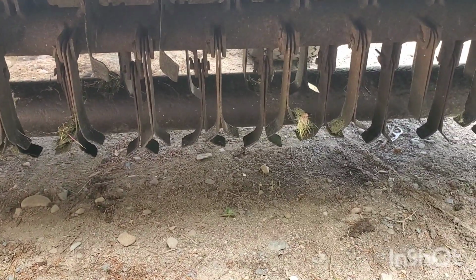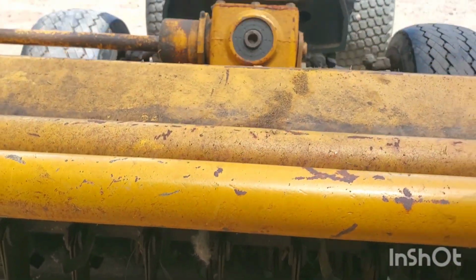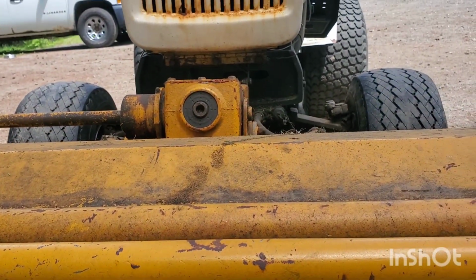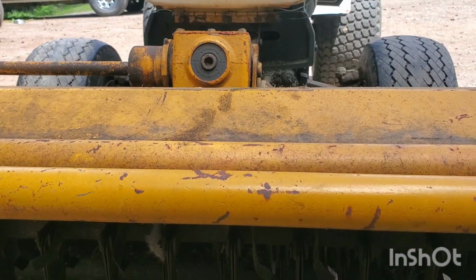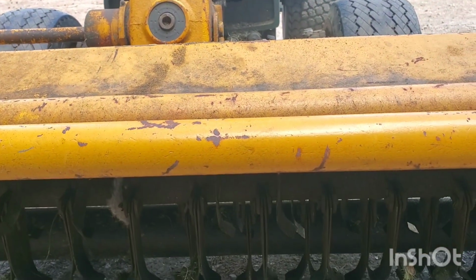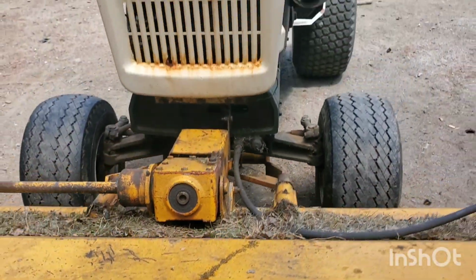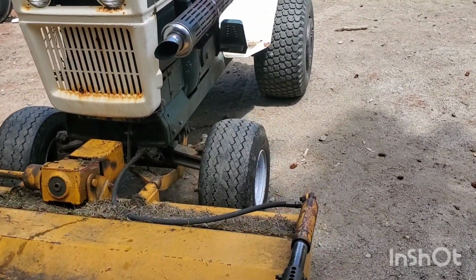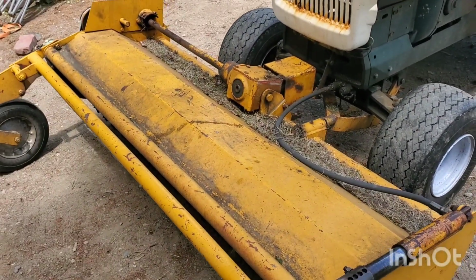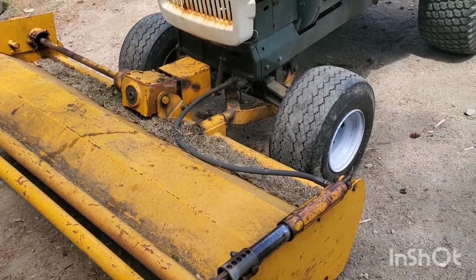You'll notice when you're starting to miss a bunch, they'll start shaking, vibrating worse. And even still, with all of them on here, I find I have to run the tractor at about 3/4 throttle. If I go any faster, it gets into a real bad vibration. But if you slow it down just that little bit, it's okay. When you're mowing a little bit under load, you can ease the throttle up, but once you get out of load, you have to bring it back down just that little bit to keep the RPM of the drum a little lower.